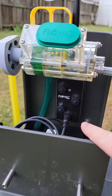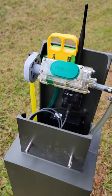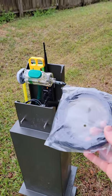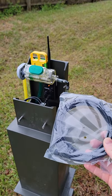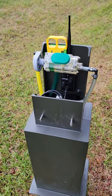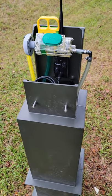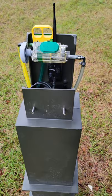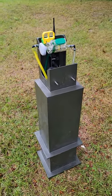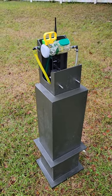In addition to mounting the controller, if desired, the dedicated air terminal can also house the FlowVac monitoring system. We can send these pedestals directly to you with the battery and module mounted, and then you would just take the communication cable and connect directly to the FlowVac valve pit on a new install, or when the valve pit already has monitoring installed. We can also send it with a kit to monitor any valve or valve pit on the market, so you can collect data, make sure you don't have SSO events, and identify inflow infiltration.